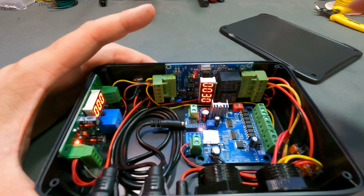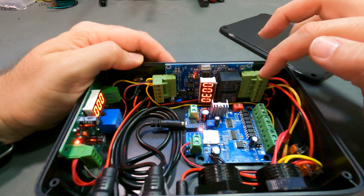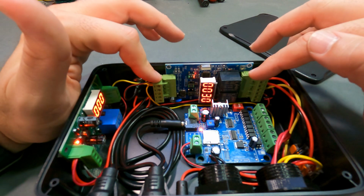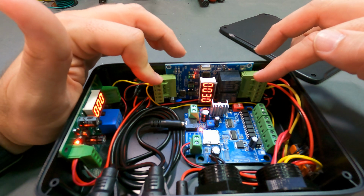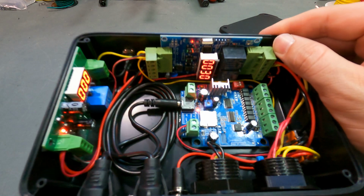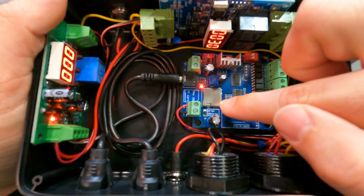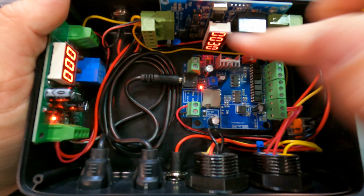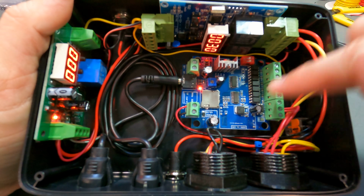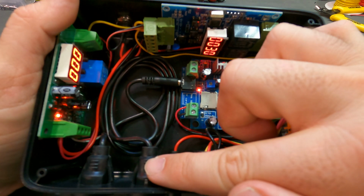So you program your bell output and your light output all on this controller here. This is basically the main workhorse for powering your devices. This board down in the bottom takes a micro SD card, which we haven't programmed for this customer yet, but we'll program the micro SD card and it will install right there. And then whenever there's a call, this system will play audio out through this port here.